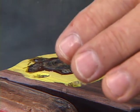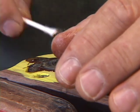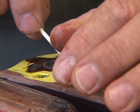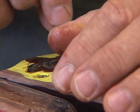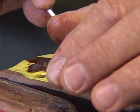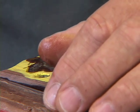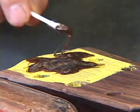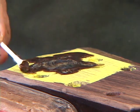I'm careful to leave enough epoxy on the top of the installed inlay to allow for settling and air bubbles. Many people who inlay a lot will heat the epoxy and surrounding area with a hot air dryer to break loose any of the air bubbles. Then I allow the epoxy to harden overnight.